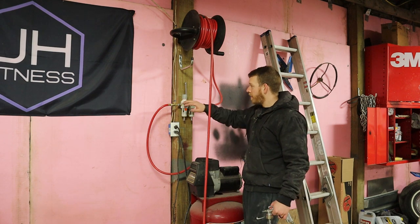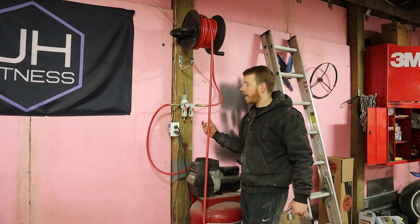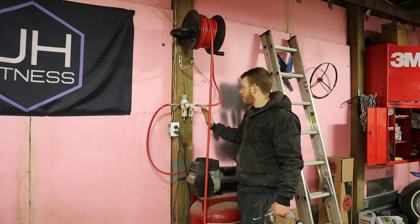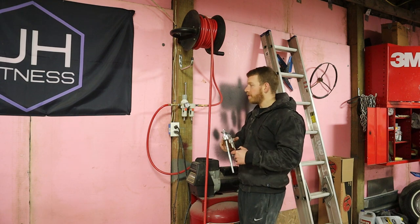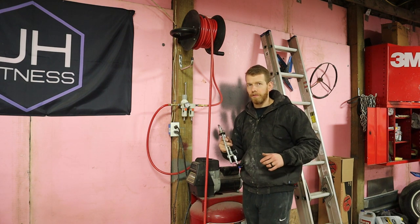I found on my projects that when the gun is flowing at 45 psi, that's what you want to set it to for a nice coarse texture. We have a normal air compressor with a line going to a couple water filters, and as you can see, they're very dry. We've been running this long enough that if there was any moisture in there, it's already out. I also have a regulator here, but we're just going to worry about having 45 psi at the gun so we make sure it has a nice texture to it.